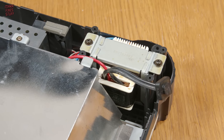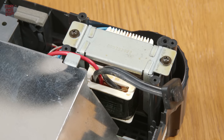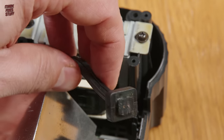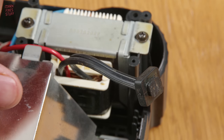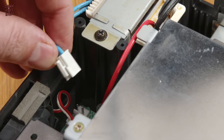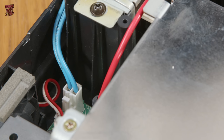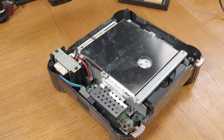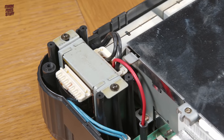This PSU is a 120V centre-tapped model for US household use. It takes in 120V AC and is meant to produce 15–16V AC. The AC voltage is fed from the transformer to two points on the board, where it's converted into DC voltages. Because I don't want to introduce any potential new faults, I want to get this console working with the original 120V AC American PSU as a first goal.